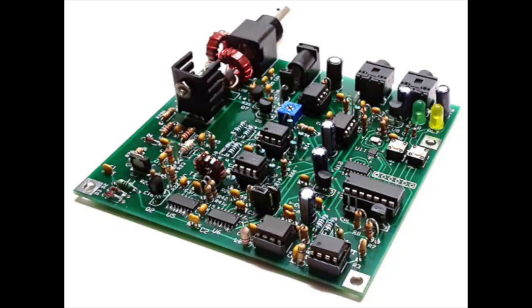Another subscriber told me about a digital transceiver that uses upper sideband and is much more efficient — it's called a Phaser. I'll put the link down below; that would be a much better choice in my opinion. When I get a bit of money I'll get one and build it. The Phaser, for a small price increase — 55 dollars against 29 — gives you much better efficiency and a cleaner signal because you don't have the lower sideband interfering with other signals. So that's probably a better choice and I'm definitely going to look into it.